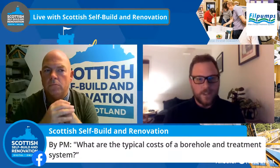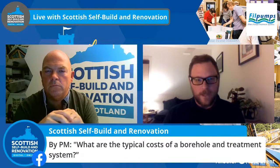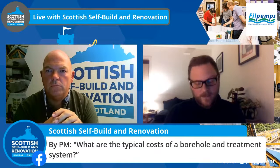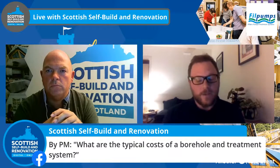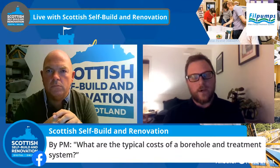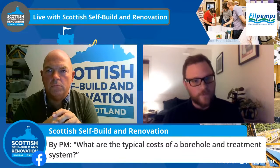And then a typical treatment system could be somewhere between £2,500 and £3,500. The caveats of that being, as we've said, we don't know in advance. It's physically not possible to know how deep we need to drill beforehand. And also it depends on the property. The treatment equipment is sized based on how much water the property is going to draw through the system.